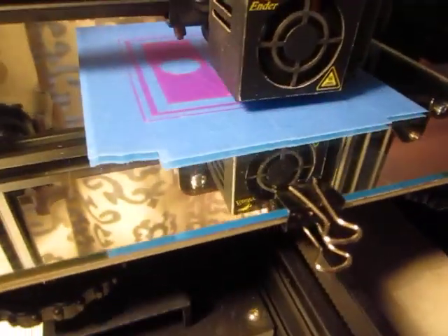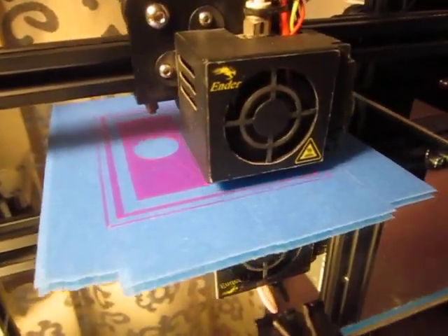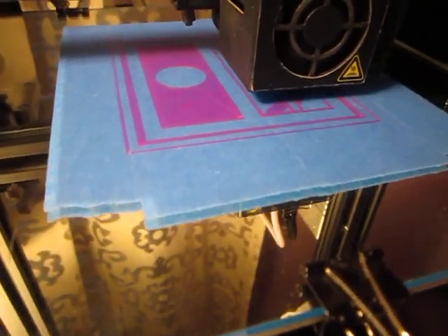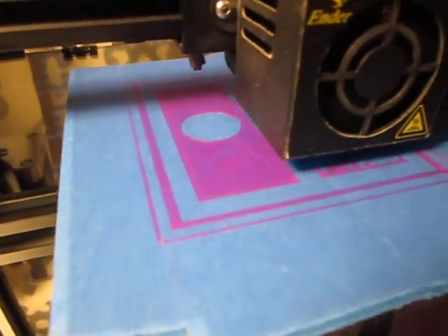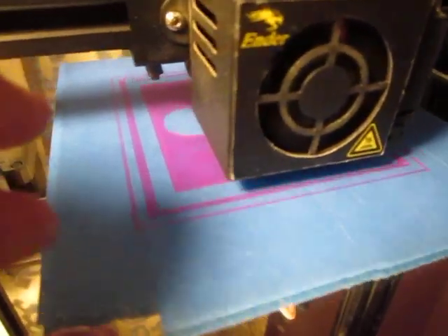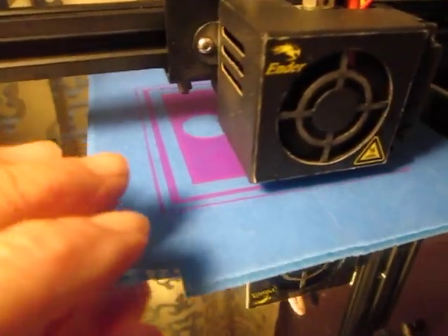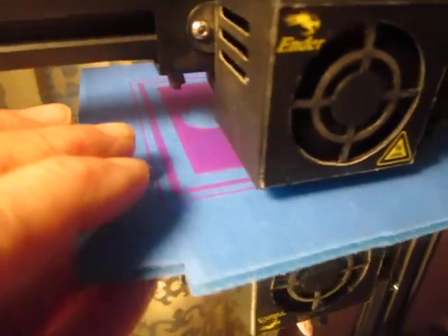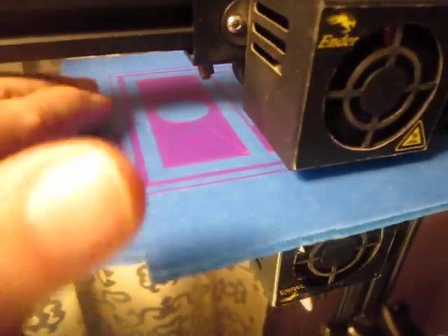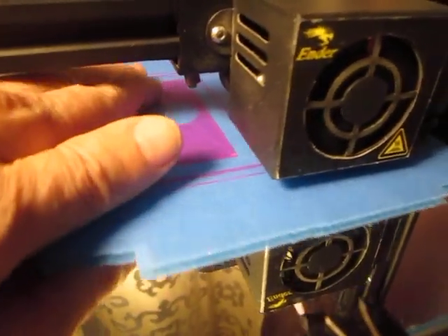This is another video — probably the third one today. I wanted to point out while I can: it's currently printing the first layer. You can see it's almost translucent, and the troweling down of the first layer is exactly the way I set it up. I always want the first layer to be smooth — no gaps, no gouges, no lumps and bumps, just literally smooth all the way across.